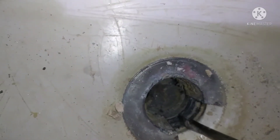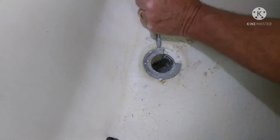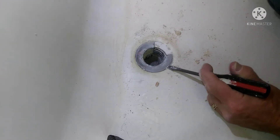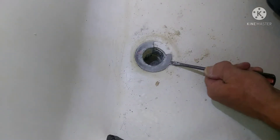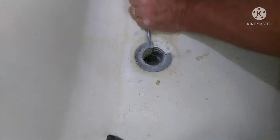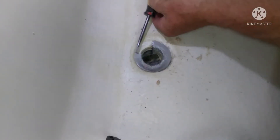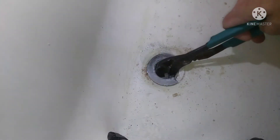It's okay if you cut into the female part of the threads on the pipe underneath a little bit to get that piece out. Once you get that piece out, I'm going to take my screwdriver and a hammer and whack it on the side there and try to loosen the threads up. If it bends and folds in half, you're ahead of the game and you can pull the whole thing out. This one's pretty thick metal and pretty tough, so I'm just trying to break the threads loose. After I whacked it a couple times it felt like it's getting loose, so I'm going to try to hit it with the screwdriver and get it to unscrew. Trial and error — do whatever works, but just be careful and take your time.